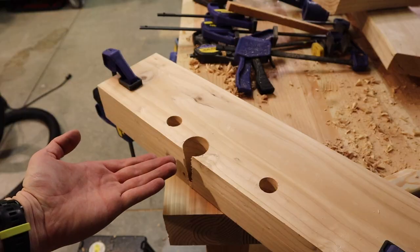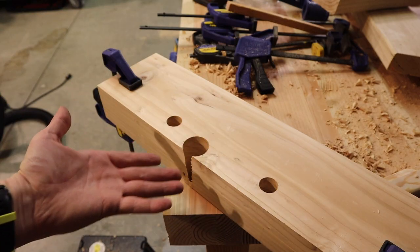And then the last thing that I learned is I would go with 2x8s instead of 2x6s on this one, because you saw a little bit earlier in the video that after I had finished using my Forstner bits, it just cut through the edge a little bit, and I could go ahead and laminate something on the bottom there to give it a little bit of extra strength. But again, those holes are just for positioning, and it's a pass-through for the screw or for the rail. And so it's not as important. So I'm going to see how it holds up. But if I was to do this over again, I would go ahead and get a 2x8, because it just gives you more flexibility all the way through, especially if you've got a 2x4 workbench and this particular ShopFox vise.